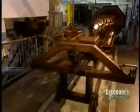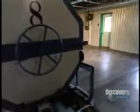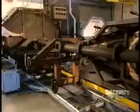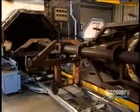Before entering the oven, the molds are securely closed with clamps to avoid any loss of polyethylene. The kayak mold is put onto a transporter and placed facing the oven. Because of the large dimensions of the craft, the oven had to be custom made. The whole kayak goes in.